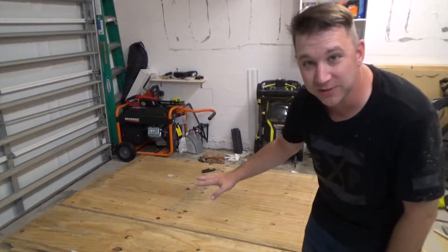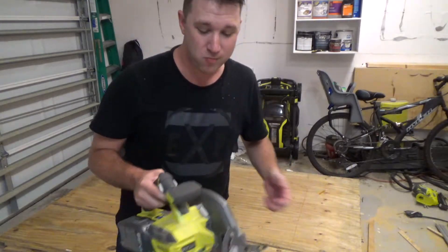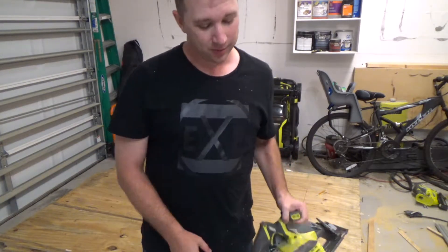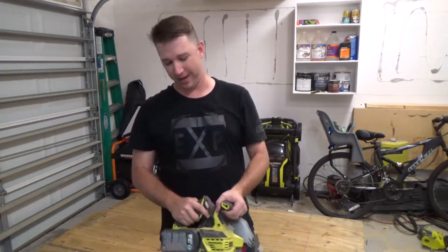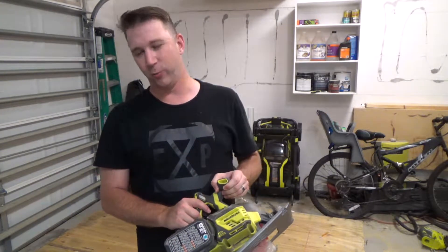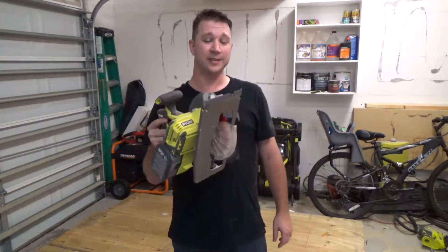The easiest way to cut is with a circular saw. I like cordless ones as long as you've got enough batteries, because you don't get stuck or get the cord caught. The downside is they don't have quite as much torque as a corded saw. My advice: use a good cordless one with a big battery. If you have really thick material you may want a corded one. Being three-quarter inch is fairly thick, but you can overcome that by setting your blade at the minimum height necessary to cut through — that way it won't bind up so much.